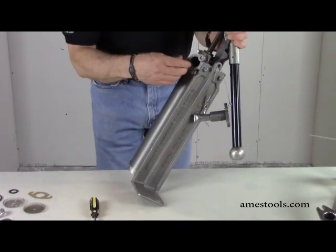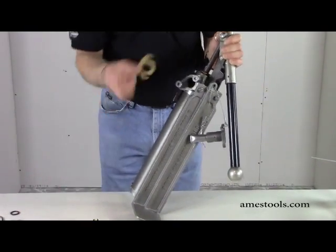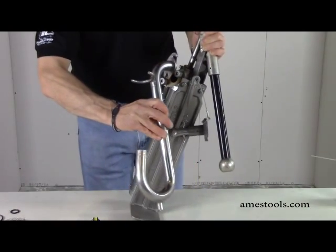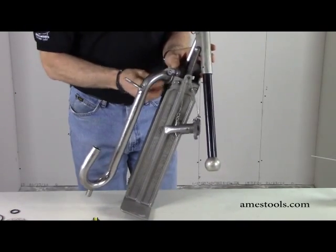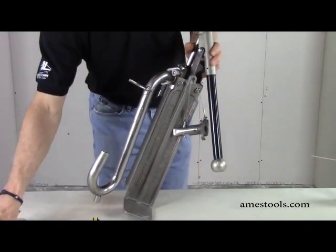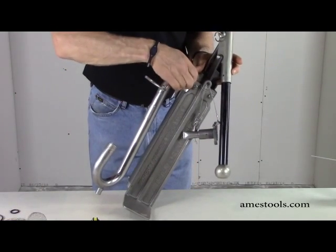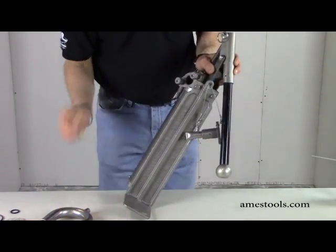On the top of the pump, you have a gasket that you put in between your adapter — whether it be the filler adapter or the gooseneck adapter. The paper gasket — you should have several of these — just seats right in here, nice and even, onto the pump head. If you're adding the gooseneck, you would just take the gooseneck, place it in, and tighten up these nuts. You can use an adjustable wrench or a three-quarter inch wrench just to snug and tighten these pieces. Very easy to install. When cleaning, make sure that if the gasket gets lost, you have a replacement to put back on, so have several of these.